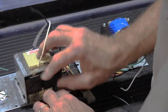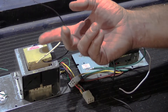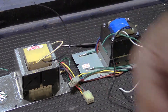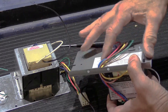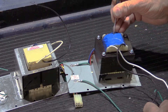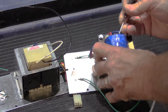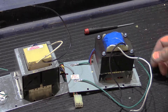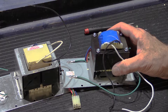This design was thoughtfully made so fuses can be replaced if they blow — replacing a three-dollar fuse is a lot better than buying a sixty or seventy dollar transformer assembly. On the Newtone design, the transformer is attached to the metal plate with screws so you can remove it, but to get to the fuses you have to cut the blue tape and dig inside. It's not entirely dissimilar to replacing fuses in Newtone 801T transformers — in some respects it may actually be simpler.